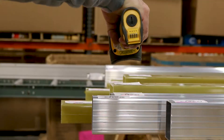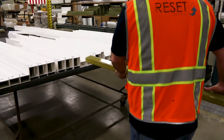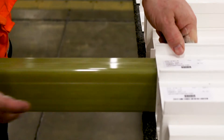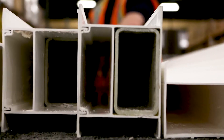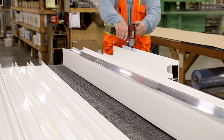Once the worker is finished, they go through and scan all of the cut pieces. The fiberglass reinforcement is then matched with the appropriate vinyl lineal. They slide each fiberglass piece into the vinyl, making sure that they fit correctly, and then fasten them together.